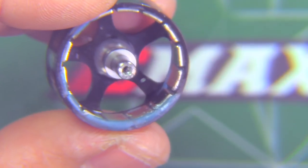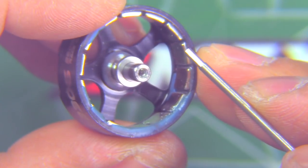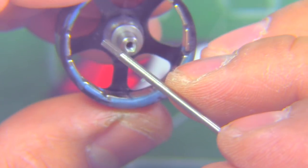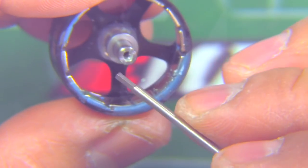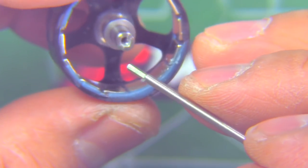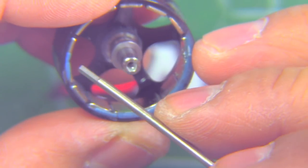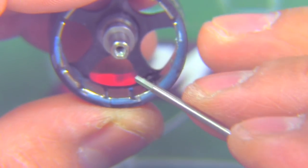One interesting thing to note is the thickness of the magnets — they kind of look thin compared to other motors. A YouTube viewer from Italy who is quite knowledgeable on motors and electronics was telling me that he was talking to his professor at university, and they were discussing the magnet thickness on the previous RS compared to these ones. The professor was telling him that on the RS, the magnets were too thick, and that most likely the back iron was saturated — the back iron being the ring around the bell.